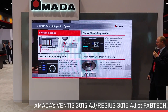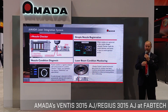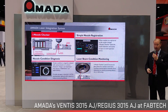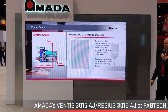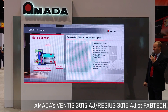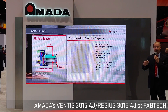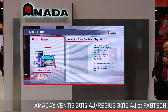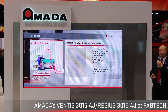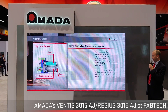The laser beam conditioning system monitors the optic lens to detect any pre-focusing changes or focus value shifts caused by heat being introduced to the optic. If that's recognized, adjustments can be made on the fly to maintain desired part quality. The eye optic sensor provides constant monitoring of the protective glass and lens. If splatter, dust, or contamination reaches the protective window, a soft alarm is sent to the operator. In previous generations, undetected contamination could burn into the glass and reduce its life expectancy.